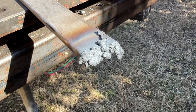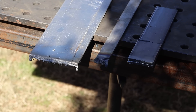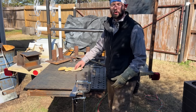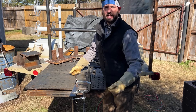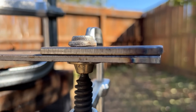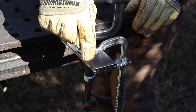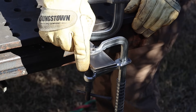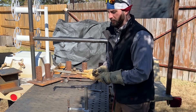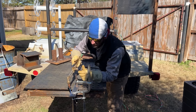We can damage and move metal with the torch regardless of what it is, but if you want a clean cut you're only going to work with ferrous metals. Now what happens if you take that same ferrous metal and stack it on top of each other? Even though it's a ferrous metal, it won't cut like you want. This is just a little piece of 3/16 plate flat bar — no problem chopping through it. But all we have to do is stack that material, same as if something was bolted to it — you just have a little bit of a void. Even if I put a clamp on here and close up that little gap, cutting through two pieces of steel poses a huge problem. We have to rapidly oxidize a point, and once we try to blow through and hit that next piece of metal, it doesn't have that ready-to-react layer — it's not going to want to go through.